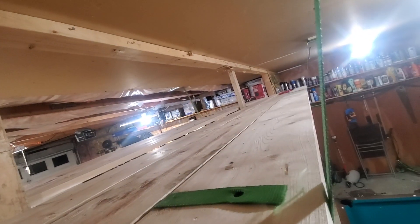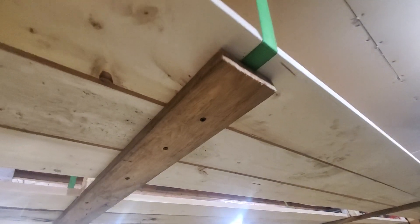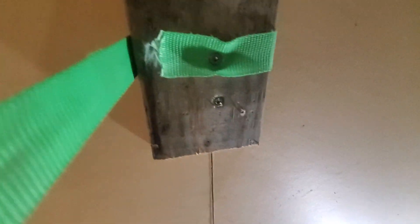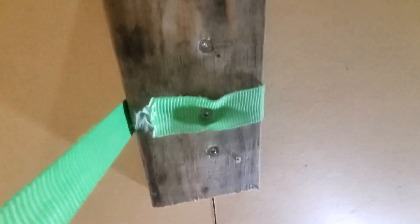A piece of regular strap — these straps are usually good for 800 to 1,000 pounds. I know there's probably people that are going to tell me I'm doing this wrong and this isn't safe, so feel free to give me any advice in the comments — I'm always open to learn. To suspend it from the ceiling, this works quite well. Pre-drill a 1x4, and then once you've got it in there, don't tighten those side two screws. Tighten it with your strap through it already. Don't tighten the edge two screws — you can pull it as tight as you need to once you have it down here.